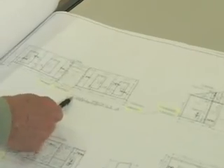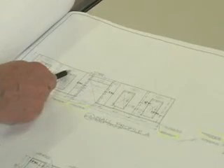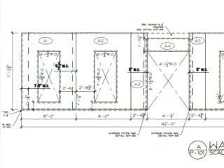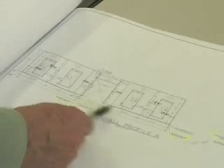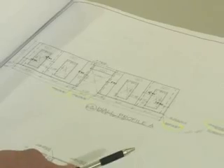We also look at the wall section details, which show you where the SIP panels are. Looking at the A detail: SIP Panel A is the first wall panel. The dashed lines show a spline, then Panel A2 with a window cutout, Panel A4 as a header, Panel A5 as a small panel, A6 and A7 each with windows. The drawing also shows an engineering detail for a Simpson strap that holds this down to the foundation. These are the details provided on your SIP panel drawings that give you the basic information.